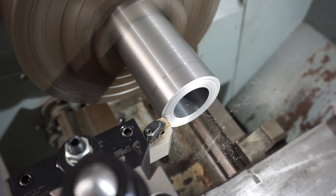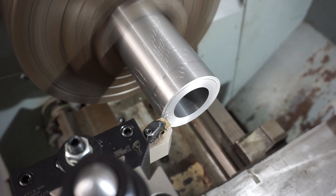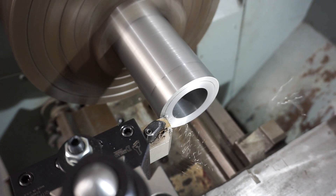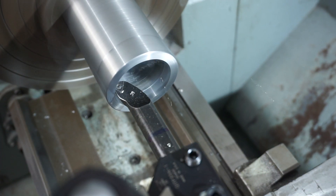I'm just flipping that around now. I need to face it down to size, and the size I was going for is 120mm. I was right on the money — I was quite surprised actually how well I got it. I measured it before I put it back in and just faced it off, taking a 10-thou cut on each pass.